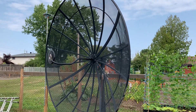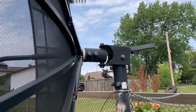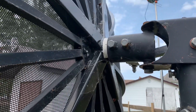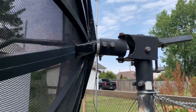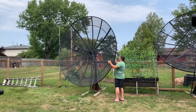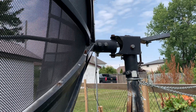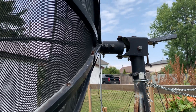The interesting thing about this dish is that it has this feature called a spin-clination. Here at the mount, the dish actually fits into this collar and you have to spin the dish. This star-shaped clamp is angled and it actually adjusts the declination of the dish by spinning it, changing the angle of the declination. A declination angle is like an offset angle to account for your geographic location, and adjusting it correctly is needed if you're going to track the satellite arc.